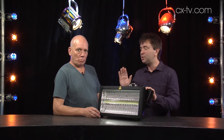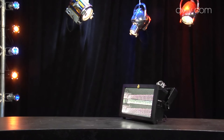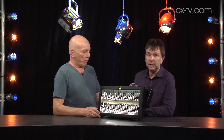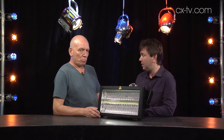You've got 228 10-watt white Cree LEDs running the traditional strobe side of it, but they've also snuck in 64 RGB LEDs. So you've got 200-and-something colors — all these extra little tricks up your sleeve to run separately. When you want to run that, it's called the Aura — you pop that into a full 14-channel DMX mode. So it's a strobe plus, to put it that way.